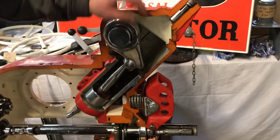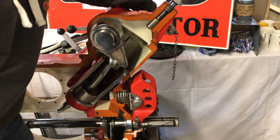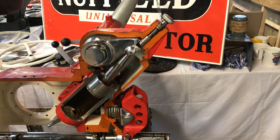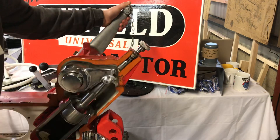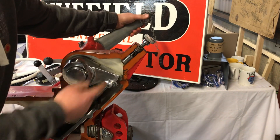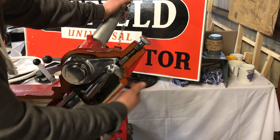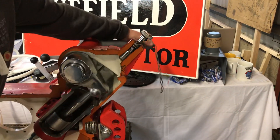We've also got the hydraulic system here. We've got the plunger locking mechanism, or transport lock. That shows how that works — it just latches in and lifts up. That always wants to be left in the out, disengaged position. Don't be tempted to use that to lock the arms up to carry a weight, because that's how they get broken.